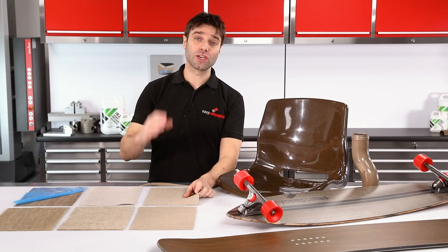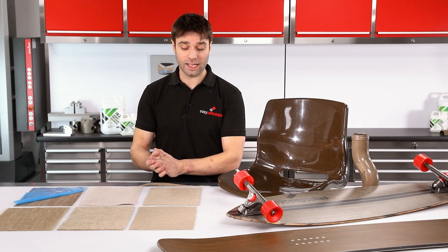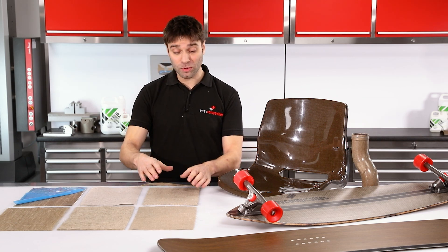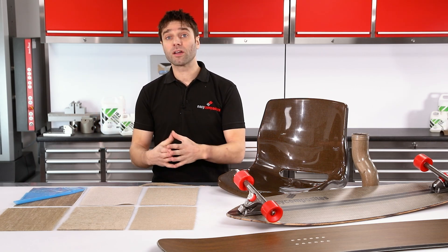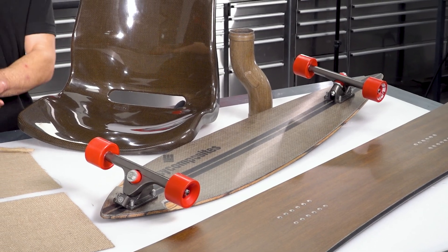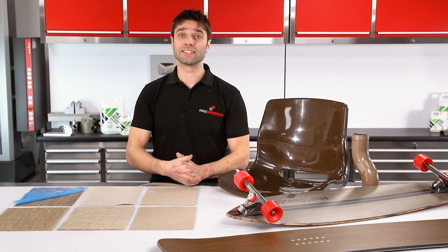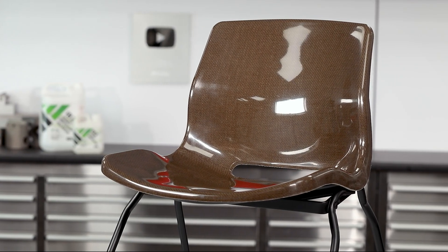So what are the main advantages of using this material? Probably the most likely reason you're going to use flax is for its environmental credentials. Flax is claimed to use between two and five times less CO2 in production than an equivalent weight in glass, and you could also argue it's carbon negative due to the carbon captured during its growth. For environmentally conscious markets such as outdoor sports equipment and home furnishings, using flax can really set your products apart. Another advantage of flax is its unique natural appearance.